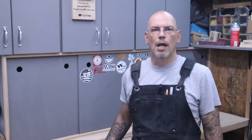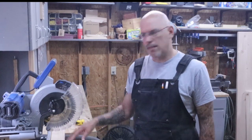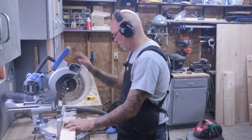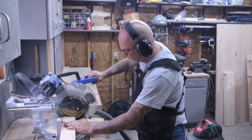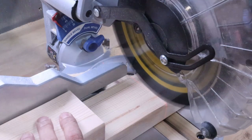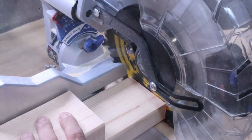Welcome back to woodcraft716.com, I'm Mike Weibel, and on this channel we build awesome projects with inexpensive tools. To get this project started we're gonna need five two-by-fours, eight feet long. We'll start by cutting our two-by-fours to 47 inches — that way we can get two pieces out of each two-by-four plus cut off the ends so they're nice, clean, and all the same size. If you don't have a miter saw, go ahead and use your circular saw, that'll work just as well.